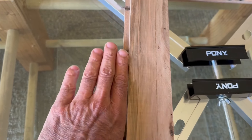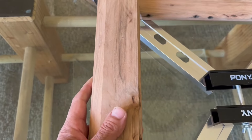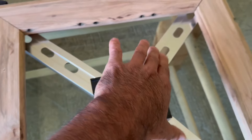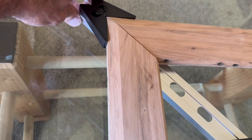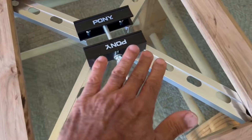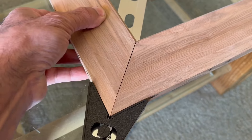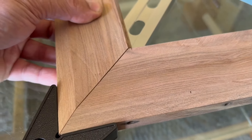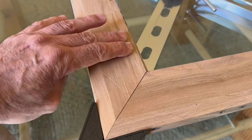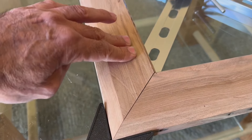Right now I want this groove right here where the glass goes, and the backing paper and all that — this is the most important part. I want this clamp flat; I don't want one of them higher than the rest, throwing the frame out of whack. Because I'm keying off the back of it, as I clamp it and tighten it I'm going to push down right here and not let it rest on that other surface, but on that back surface.